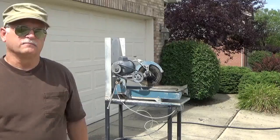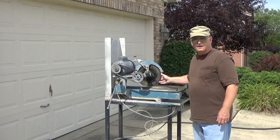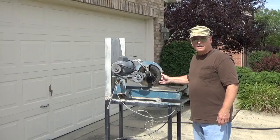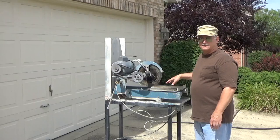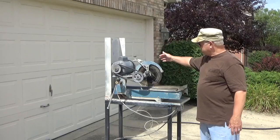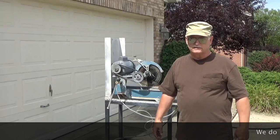The saw is probably 1950s or 1960s vintage Felker Dimet. The base and the frame are all cast iron — it's a good, strong two-man job to move this. It's a 12-inch diamond saw, and you'd think that would allow you to cut six inches, but it only allows you to cut about four, from the bottom up to the hub. This has a sliding table on it which helps move things through, but it's all manual and there is no vise, which is unfortunately a disadvantage you have to deal with. I have water hooked up through a garden hose to lubricate it — it's a one-pass water system to cool the blade.